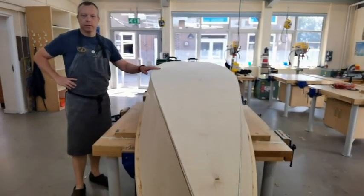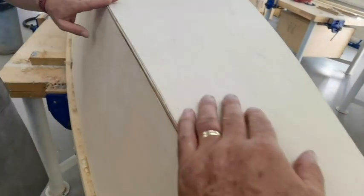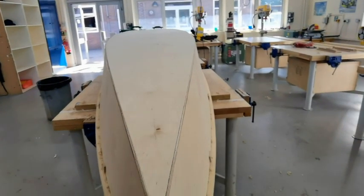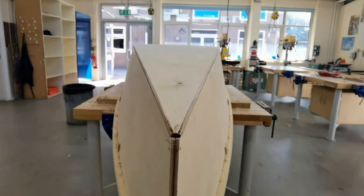Hey, look at that. Mark's rounded off. There's a tiny step in at the sand back - that was deliberate there. Only a tiny step. So I'll sand that back so it's got the nice flowing curve there, and that'll get glass taped. Next, the end needs sanding, but I'll wait until that outwall is off, and I'll tidy all that end up, and then it's going to be a glass fibre tape. So we're not far off the next bit of mixing up some epoxy now. Brilliant.